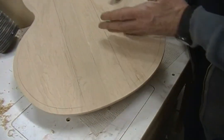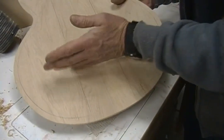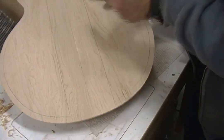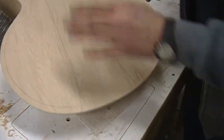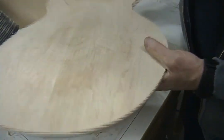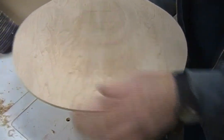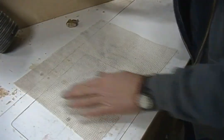And so he could predetermine his arc and make a template. And then that's what he did. He went back in and cut grooves across, and made sure that his different templates matched that radius, that he carved a radius to match the template. Then he did the drill bit thing where you put a pin on your drill press, and then you come down to it and set a predetermined dimension. I have that set up in my press right now, but I'll show that to you later.